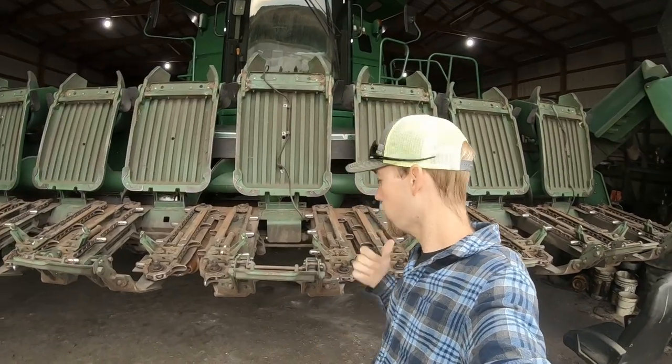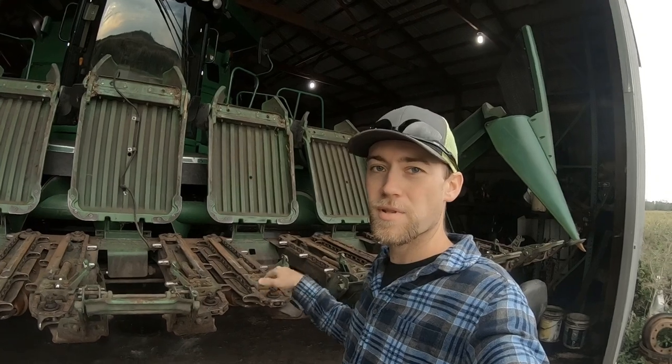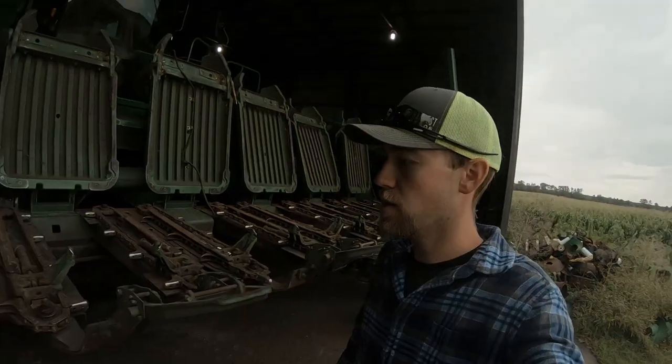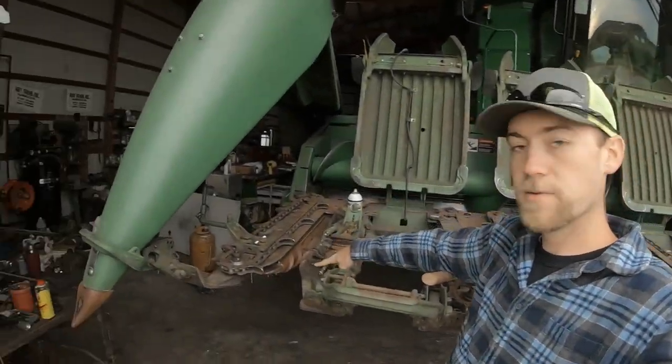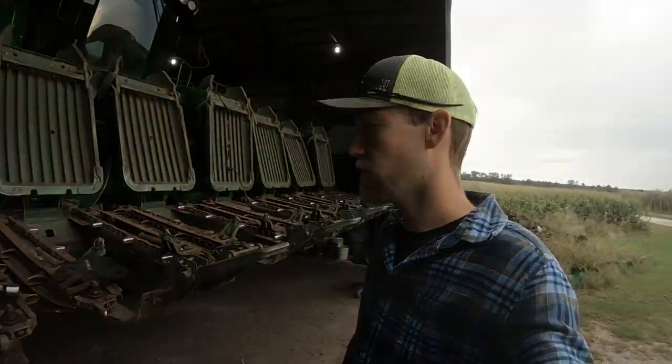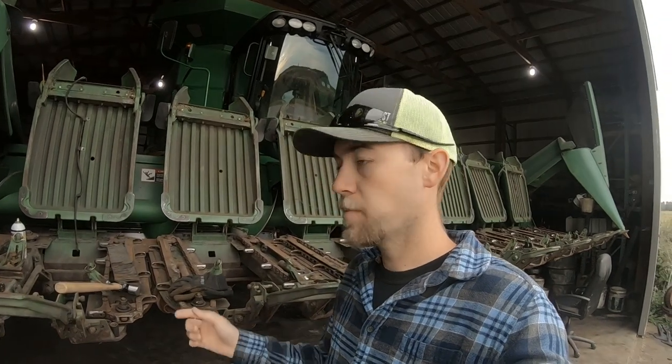So yesterday I got all these chains, I took them all apart, got them freed up to clean out underneath where this bottom sprocket slides, so they will move now. I had one bolt break off. I actually had two bolts break off. Got the one out pretty easy with vice grips, but this one's giving me some fits, so I brought my torch. I'm gonna try to give it some heat. If not, I might have to weld a nut to it and try it that way, so.